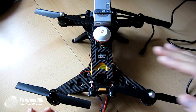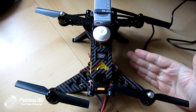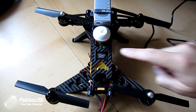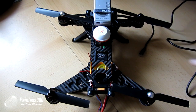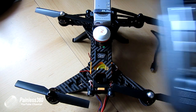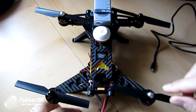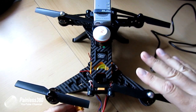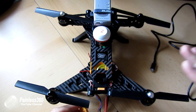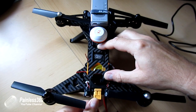The first thing we have to do is plug it in and power it up. If you don't power it up, although it will connect, you won't be able to see any of the readings. Although this is running MultiWii code, it's not a normal MultiWii — if it were, we could power it from USB. I'd always recommend first powering on your radio and making sure that's ready to go, then plug in your model. For extra safety the first couple of times, I'd also recommend taking your props off — if anything wacky happens, you'll be safe.